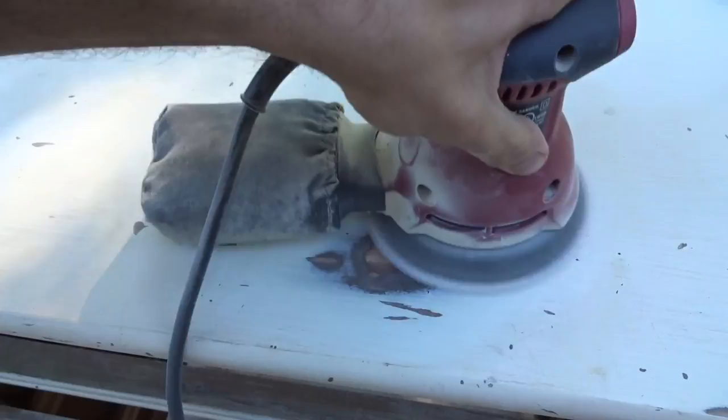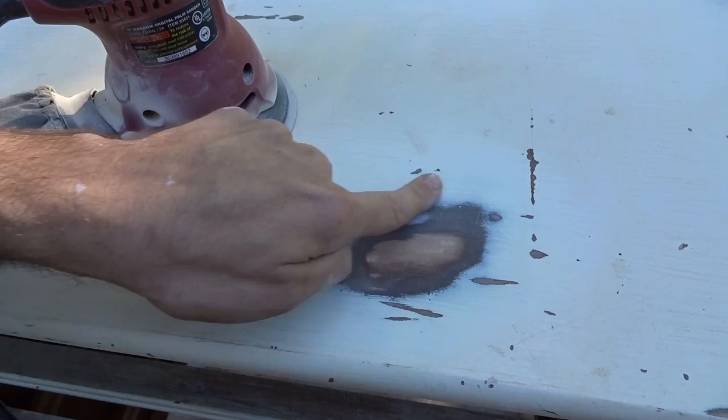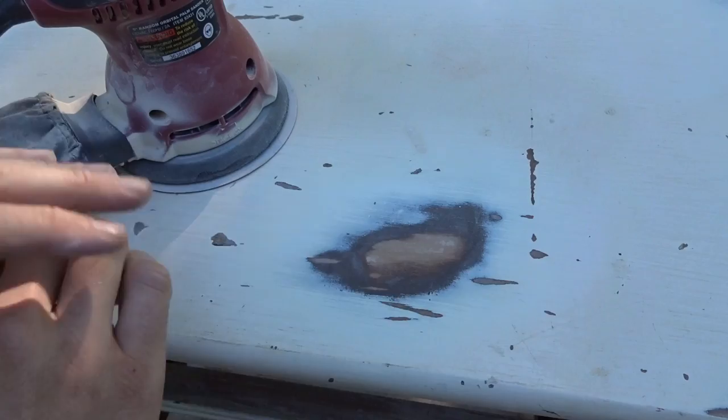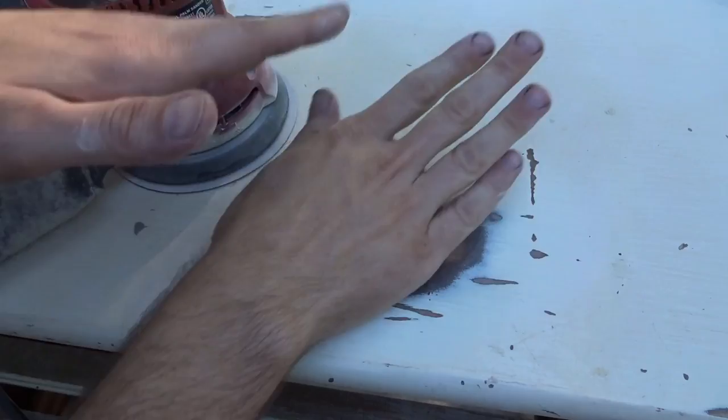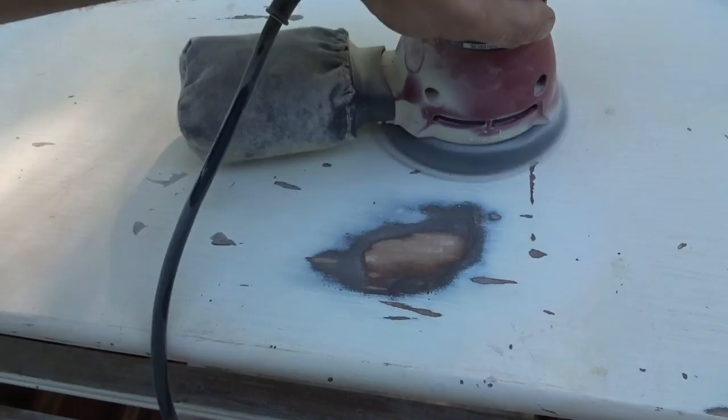On the little chips I'm just trying to feather them out so there's not a harsh line. I'm using a 120 grit disc on my sander, and once you can't feel any edge anymore I just leave it alone. I'm going to spray paint it and distress it anyway, so it doesn't matter if the paint job isn't amazing — there can still be little dips — I just don't want really harsh lines from the scratches.